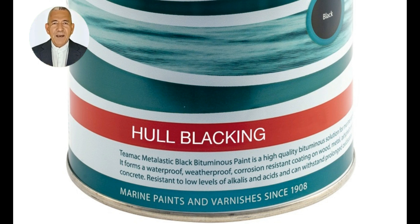The hull sides need to be jet washed, usually with up to 3,000 PSI using both cold and hot water, which is a form of steam cleaning. The underside of flat-bottomed boats is generally not cleaned or painted because deterioration there is minimal and use of the canal renders painting superfluous.